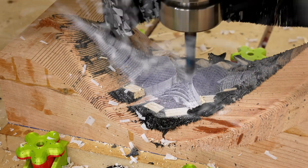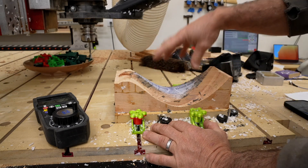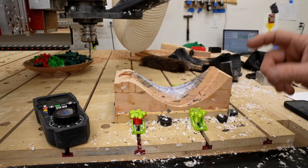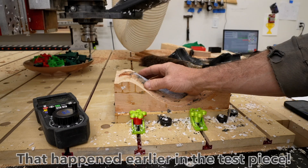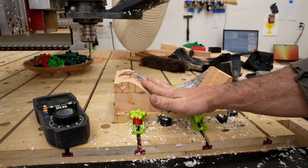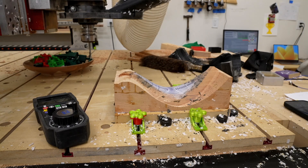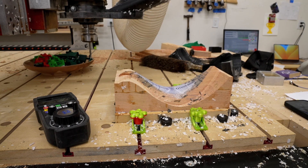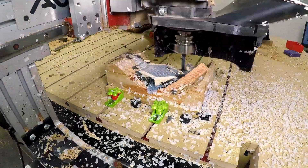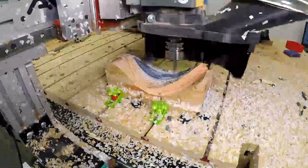I did a 3D adaptive toolpath to rough out most of the waste, then started my finishing operation and it wasn't cutting. It appears my roughing operation went too deep. When I compared the Z heights of the bits, my roughing bit had some pullout — I measured it at about 39 thousandths of an inch. So I needed to make my Z about 39 thousandths of an inch deeper to account for that. Luckily it didn't cause any issues because the bit pullout had happened before I started the project and I just didn't notice. I reset the tool height and continued roughing for the subsequent petal pieces.